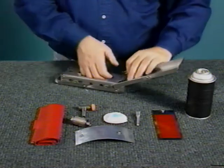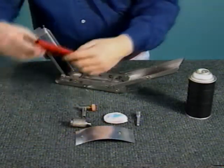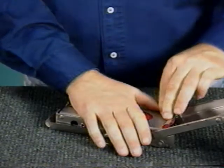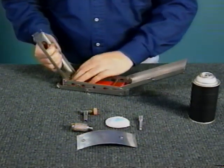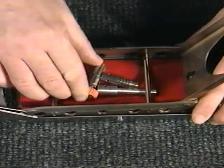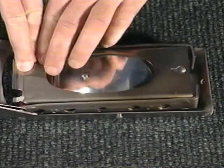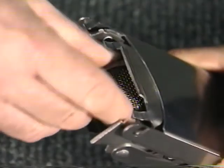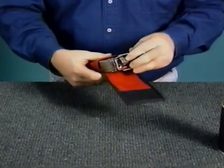To put your unit back together, lay the unit flat in its original closed position and open one side completely. Clip the rivet on the reflector into the hole on the oval arm. Check to see that the seat pins are on both ends of the folded seat. Hold the seat against the mirror and fold the oval arm down — do not pinch the seat against the frame support rods. Turn the unit over and open that side. Put the mantle post and the butane valve between the frame support rods. Slip the mantle post under the support rod closest to the oval arm. Install the new mantle for the next use on top of the butane valve. Cover the accessories with the heat deflector, pointing the end of the heat deflector under the support rod closest to the cover plate. Close the oval arm, then the cover. Insert your heating element at the open end of your Campanion between the seat pins — do not force any part into place. The Campanion is now ready for its carrying case.